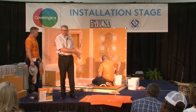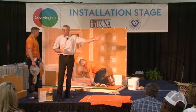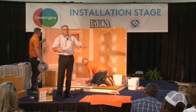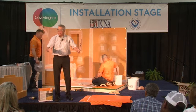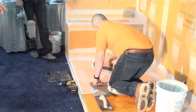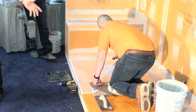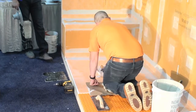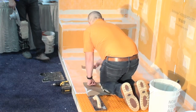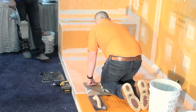This would certainly be considered a wet area, and now that we've removed the curb, there's the ability for the water to actually come outside what was traditionally the wet area to what was traditionally the dry area, right? So now this is going to protect the OSB from ever seeing any water, right? And we're also going to be able to put in-floor heat in here with the cable system. So think about the performance. What do you need out of your floor? What are the requirements? That's going to help you select the DITRA that you're going to use.